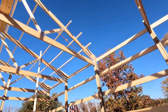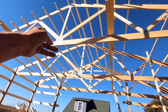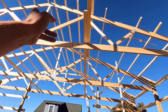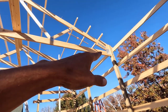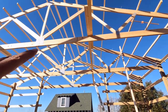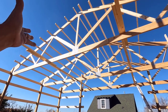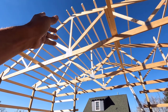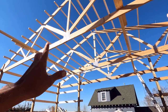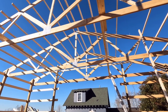All right, the day is nearly over and I've filmed almost nothing, but I got the last three purlins on that side and then all of the top purlins on this side, and then I just started from the bottom. The top purlins are by far the hardest to do if you're doing it from a ladder. I have to put a purlin in, then adjust the ladder to lean on that purlin, and then get the next one in. And I have to fasten it in three places, which involves taking the ladder completely down and going to another bay. It takes a long time.